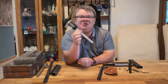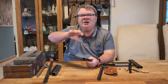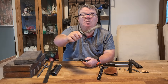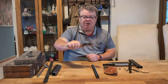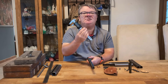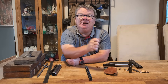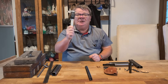We now have such a thing as a digital vernier. Another reason for the video today is I put out a short last Friday - a 10-second thing because Lidl, in the middle of Lidl, they've got a special offer on digital vernier gauges. These little groovers here, like this one, for a fiver. It may not be as ultimately accurate as a Mitutoyo, which is a hundred and something pounds, but it is good enough for what we need. All you do with this is just opening it switches it on. You press zero, then you put it inside your spring, open it up, and presto changeo - 14.28 millimetres. And that's it. 14.28. How do you know it's 14.28? Because it says so on the screen. It's absolutely brilliant. I need you to have something like this. Lidl is a fantastic place to buy it, but other places are available - Screwfix or Toolbank. You do need one of these.